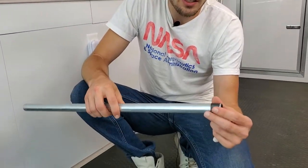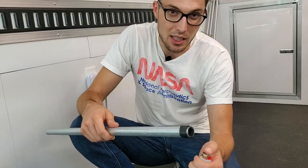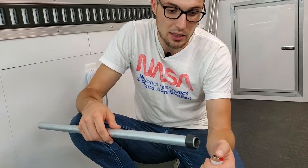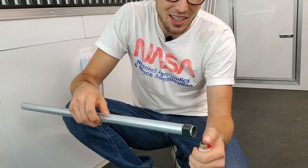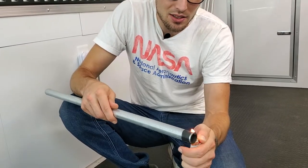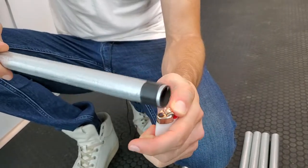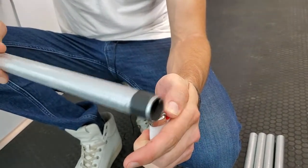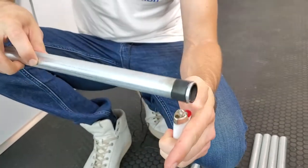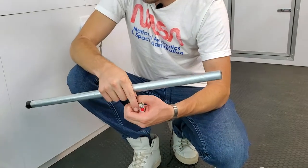These connectors come with little heat-shrink pieces — without them, the clamp can slide on the pipe. I'm using my 24-inch pieces to start squaring out the frame. Slide the heat shrink onto the end of the pipe, then take your lighter — or better yet a heat gun, which is probably safer since the lighter gets very hot — and heat-shrink it down until it's snug and tight.